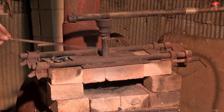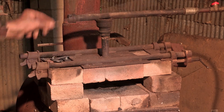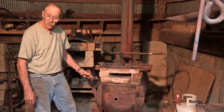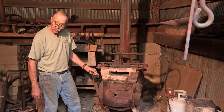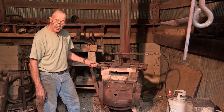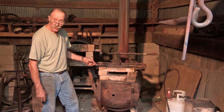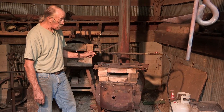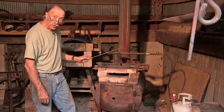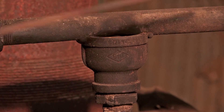I have a clamping system here on mine that holds the brick together, but you could use angle iron laid across the fire brick to make a lid, a top. The forge is sitting on an old wood stove here in the back of the shop. You could lay it out on a steel table or on a stand that's fireproof, because this brick gets to 2300 degrees. All the parts are readily available and easily assembled, so for less than $60 you can build a forge that you could use in your garage or your front yard and not disturb the neighbors. Outside we'll have the parts laid out so you can see each individual part, and with only a little bit of help from your local welder to tack weld the pipe onto the bell reducer, you can prepare a furnace yourself in a weekend.